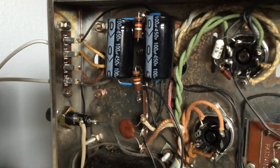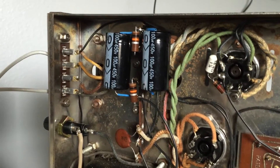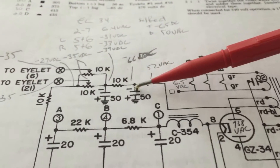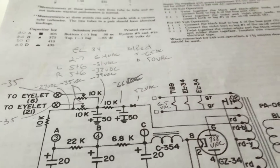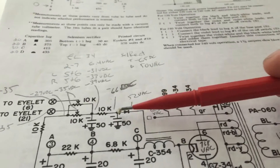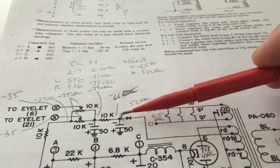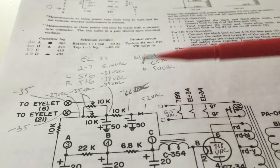These capacitors essentially provide the same function for two different circuits with two different polarities. You'll notice when looking at the schematic diagram that the negative side of the capacitor is in the circuit and the positive is clamped to ground. That makes sense since this is a negative grid bias and the product here is a negative voltage. This negative voltage is stabilized by the reservoir on the negative side of this capacitor for fluctuations in voltage, and it also helps smooth out the ripple.